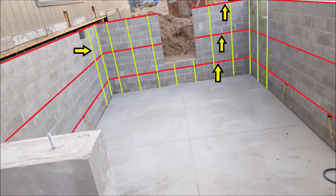The vertical reinforcement consists of half-inch rebar that starts at the footer and goes all the way to the top course, and is spaced every 2 feet on my block wall.